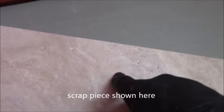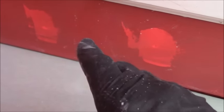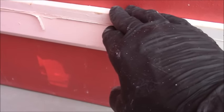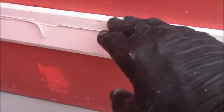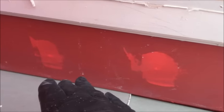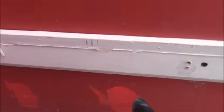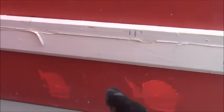You are coming up. This tile happens to be 12 inches, and it's not 12 inches nominal, it's 12 inches exactly, because I know that my lowest point of my shower, from here to here, is 11 3/4. So I'm a quarter inch off on purpose, because that's what's eventually going to be shaved off. As I go around the shower, that measurement may change with regard to the bottom tile that I eventually cut after the ledger board is taken off, but it doesn't really matter.